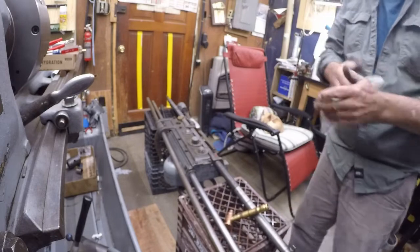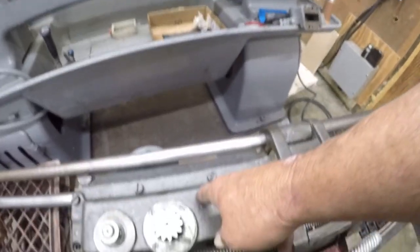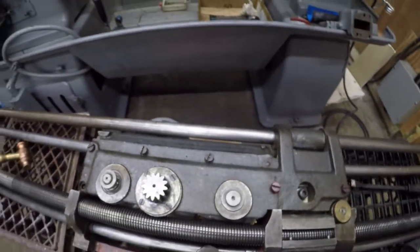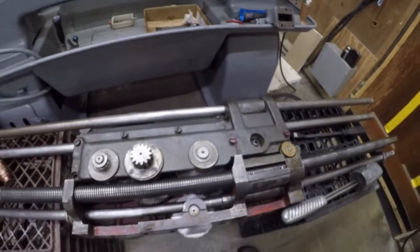Let me go handheld here. Okay, the last thing I had to do to get this thing to sit all the way down is we have this rectangle rod here. It runs the length. You can just see it there and here. Somewhere right around in here, it has a hole in it, and there's a location pin there, and that has to be engaged. So to get it down tight, move this thing around, pushing either end until it drops into its hole.